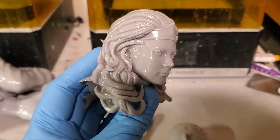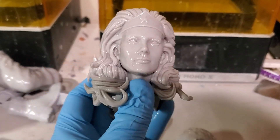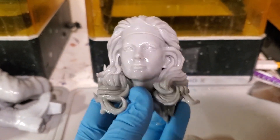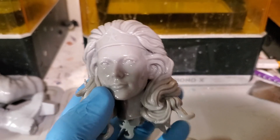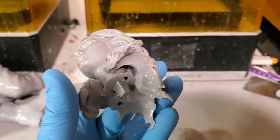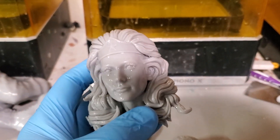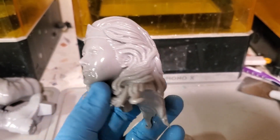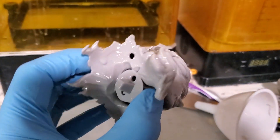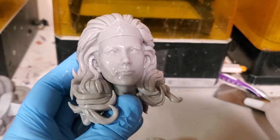I'll soak it and take a toothbrush to agitate it a little bit in the alcohol, to get any excess resin and residue off the outside. If you don't clean the outside thoroughly, when you cure it it's going to look splotchy — you can have a chalky substance or resin splotches where it's not fully cleaned off. I take the supports off before putting it into the alcohol. A lot of people leave supports on and warm it up with a hair dryer first, but I don't want to dirty up my alcohol any more than necessary, since those supports have resin all in them.